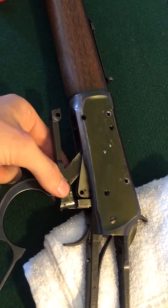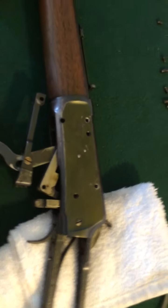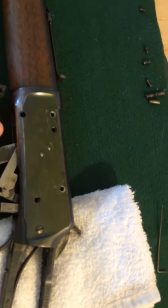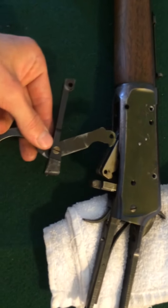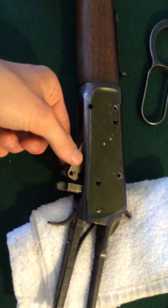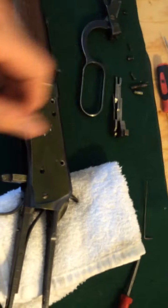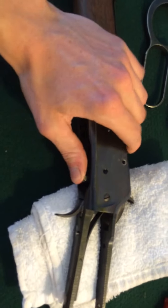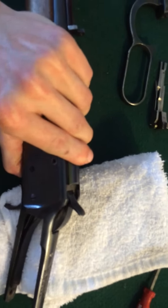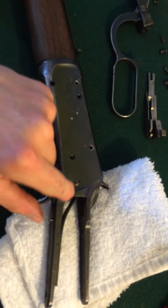The action will begin to fall out a little bit, which is perfect. You take this and it will slide off. That was on there, so that's free. This will become free and pull out since we removed the pin that was holding it. This elevator will now pull out — set that aside. I'll push that back in, and all that does is hold the bolt in place while I disassemble and remove the trigger group.